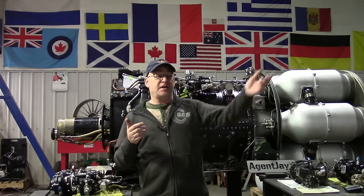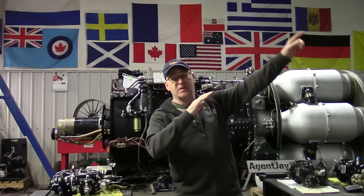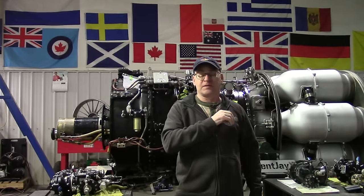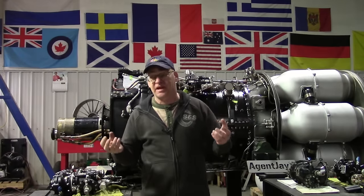That's not so bad in an airliner at cruise at 35,000 feet, but if you're in a fighter jet doing something you have to do, or even just taking off, you don't need a momentary interruption of power. Especially between rotation and when they start to cut power on the climb out — you need reliable, massive amounts of power. Even a small fraction of a second of interruption could be disastrous. The boost pump supplies pressure at the face of the fuel pump — it doesn't need a lot of pressure because the pumps don't work in sequence. It just presents a reliable supply of pressure to the fuel pump that it can draw from.